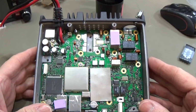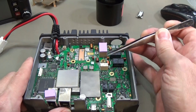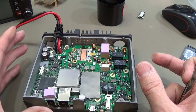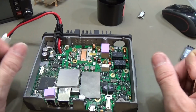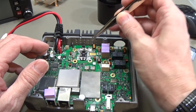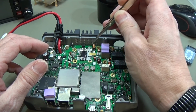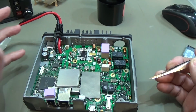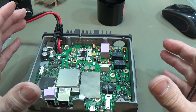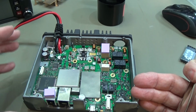Okay, so before I now put in the new amplifier, I have fixed the board with 3 screws, only to have the board right in position, because let me take the old one. When I put it back, I need to align our amplifier first and then tack it down at minimum 2 points, just to have it aligned, and then I take it back out to solder it finally in.